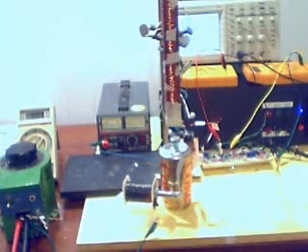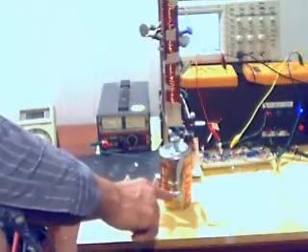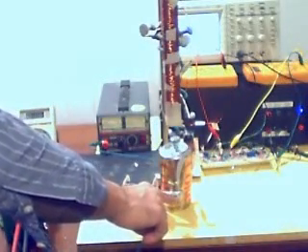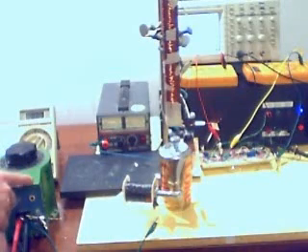What I'm showing today — December 3rd, 2008 — is a demonstration of the magnetic levitation apparatus. We are going to levitate this Coke can using magnetic levitation, and then make it turn using an eddy current motor setup, which is simply an AC coil with a bolt on the end. The nut is essential for rotation. This is powered from about 8 to 12 volts AC from this variac.